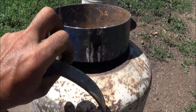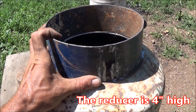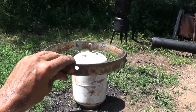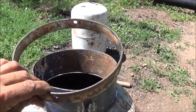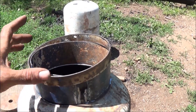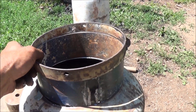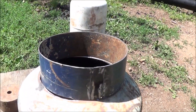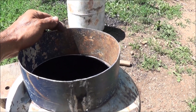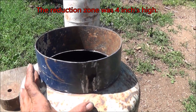This old ring right here — what we're going to do is weld this to there, just like this. So that ring, our reduction zone, is going to weld right onto the upper container. This ring that I measured to make sure it could slide inside of is going to weld onto the top of that tank back there. That'll give us that seal. We'll use the ring from the bottom of that tank to go around the two of these — that should give us a nice gravity-based seal. As the upper mass sits down on the lower ash catch and seals it all together, I'll show you the oven stove door rope we put inside of that. Now I've got to go ahead and weld this, get it centered, and then make a screen for right here that can open and shut. Put the cable on there so we can do the ash dump.